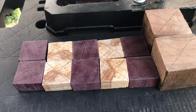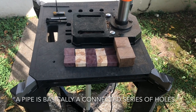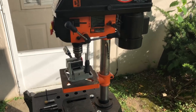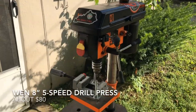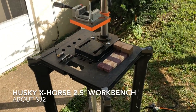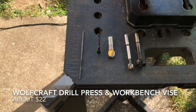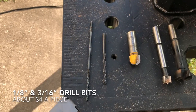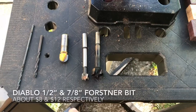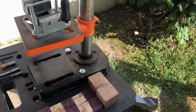Now that the pieces are sufficiently planed and marked, they're ready to be drilled. Since the pipe is basically just a connected series of holes, there's really no way to get around drilling, so a drill press is necessary. You can pick up a small one like this for not too much, along with a folding stand that can be put away conveniently. You're also going to need a drill press vise and drill bits — at least an eighth-inch and a 3/16-inch bit. The bowls are going to need a 5/8-inch core box bit and a couple of Forstner bits: a half-inch and a 7/8-inch.